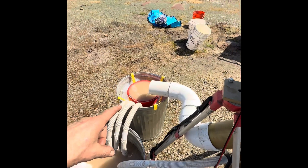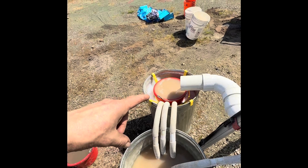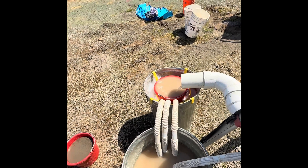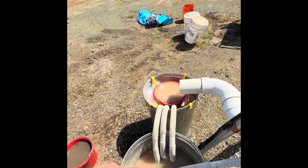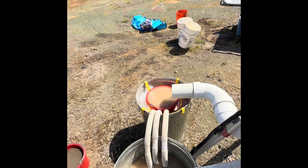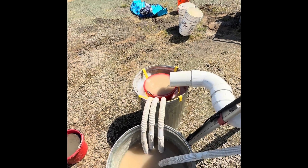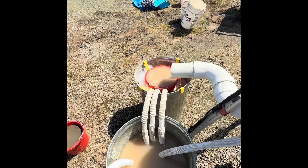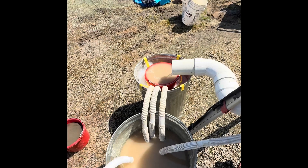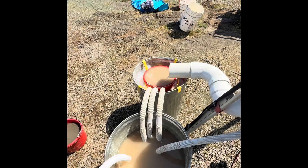As the water comes into the tailings bucket and the level of the water rises in the tailings drum, that forces the water through these siphon hoses and into the pump drum to maintain level water between the two drums — that's how the water recirculates through the gold drop. The water siphoning into the pump drum is minus the solids draining into the tailings drum, so the dirt and silt can dirty the water but it does not interfere with the operation of the gold drop system.